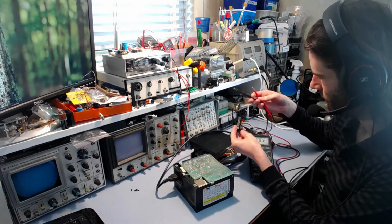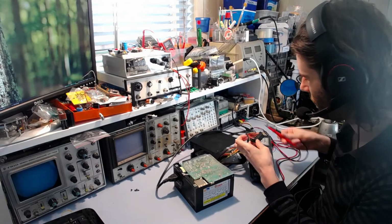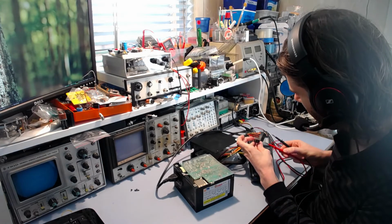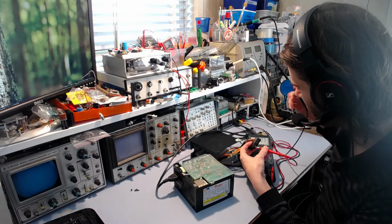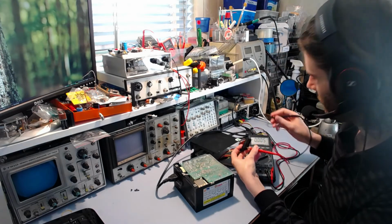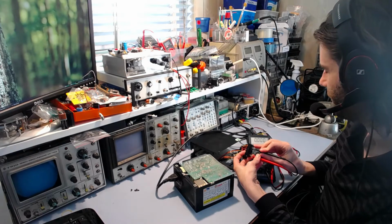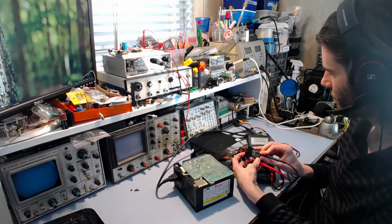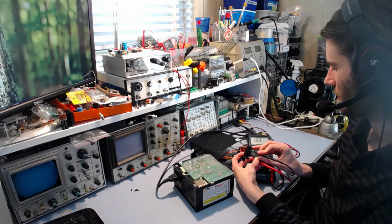So if I go by the standard ATX pinout, that's the purple wire. This is a standard one on the Dell. Some older models of Dell have a different color scheme, so you have to watch out for that. For this particular one, plug it in, we get absolutely nothing. 0 volts. Completely dead. It's just not outputting anything.